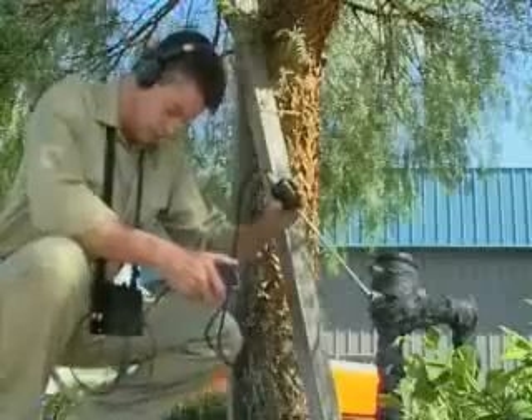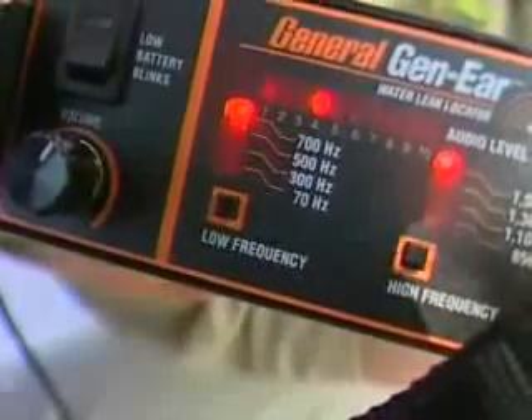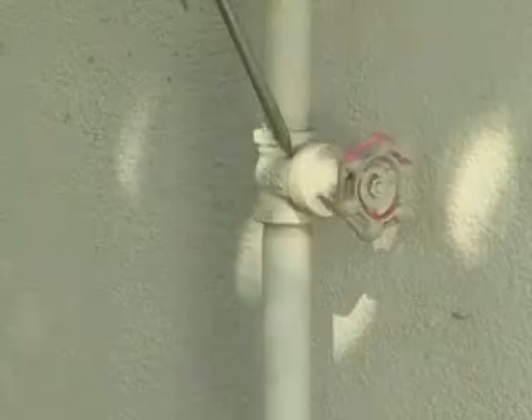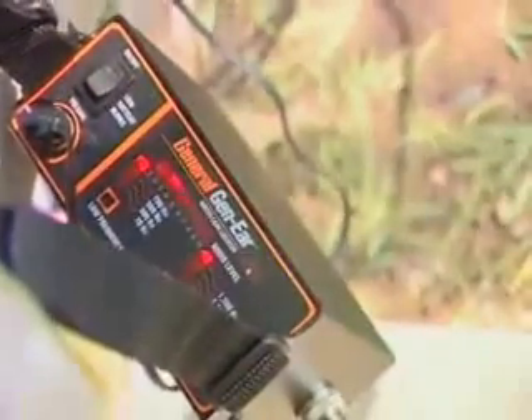This gives you a general location of the leak. If you hear the sound of a leak, check lines running in all directions from that point. The leak location is usually found between the loudest and second loudest survey locations. Now you can begin to narrow your search and isolate the leak.